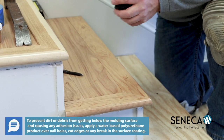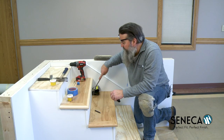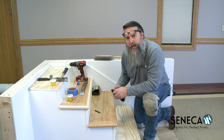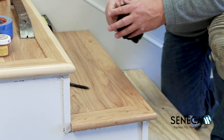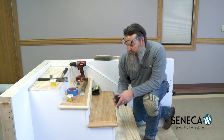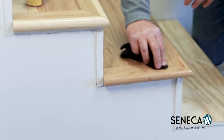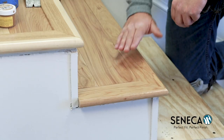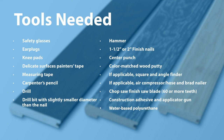You can see there's a little bit of a gap here — that's nothing to worry about. What we can do is take our pry bar and give it a little pull back before the adhesive sets, and work it a little bit if you've got a gap. That's something I can adjust from the back side rather than fill with putty. I've countersunk the holes, filled them with putty, and as you can see it's already starting to fill. I'll go ahead and wipe them down, and that's a fully installed flush mount step. Thanks for watching and good luck on your next project.